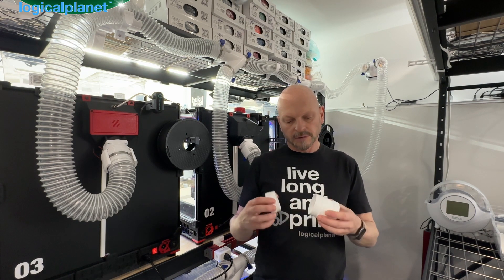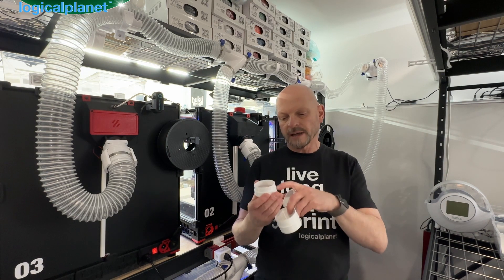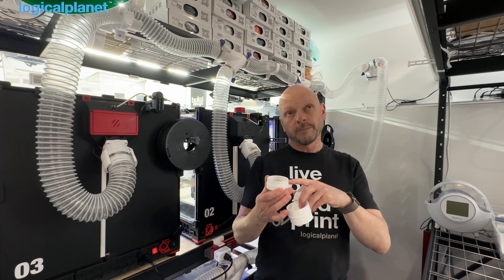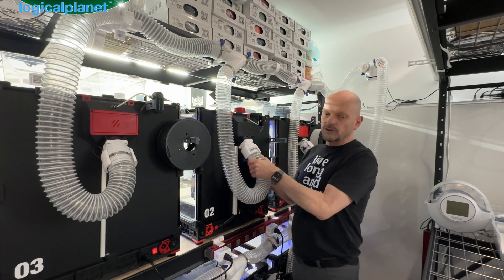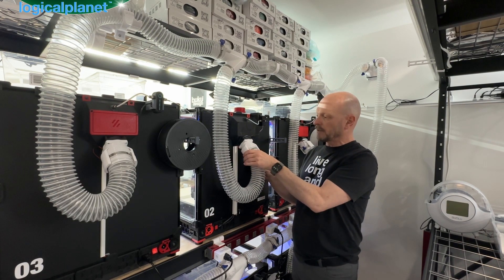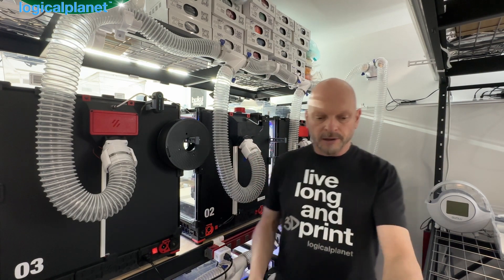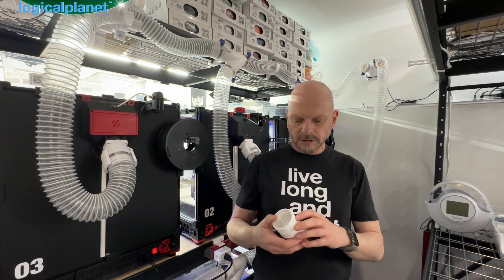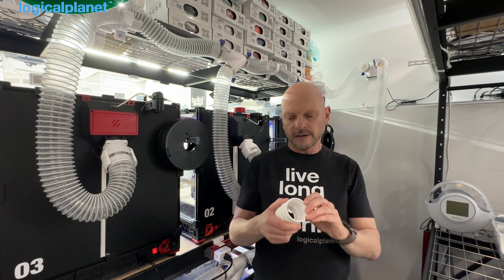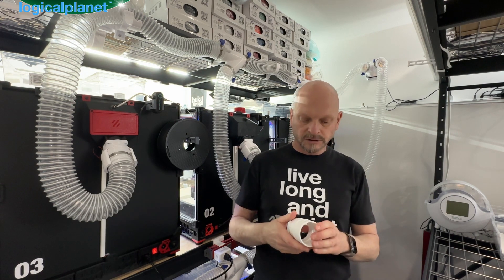The reason I made all the accessory components as glued-together assemblies is that by doing so I can print them always in the right orientation to the bed, so I get a super sharp surface parallel to the print bed. That's absolutely critical to getting a really strong connection. Because of that I can't pull these off without squeezing the handles. I tried all sorts of other strategies and this became definitely the winner. You could do the same thing with support, but I couldn't get the same clean edge.